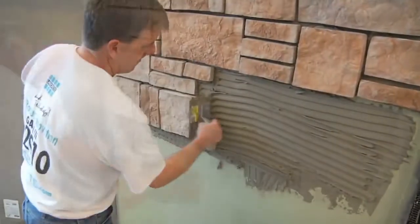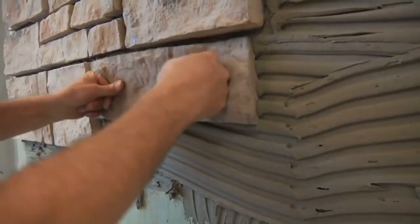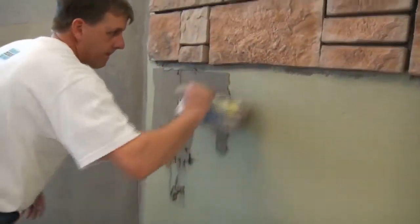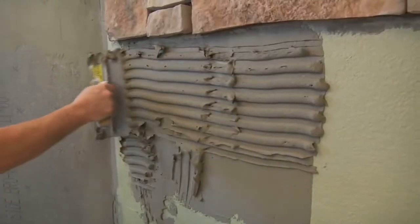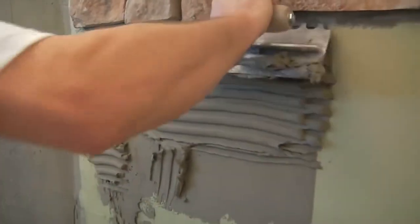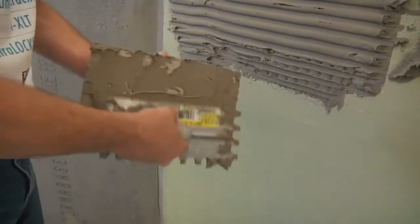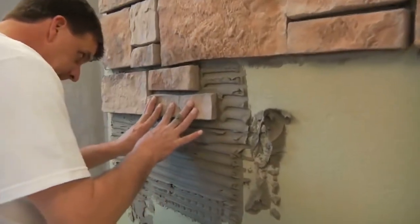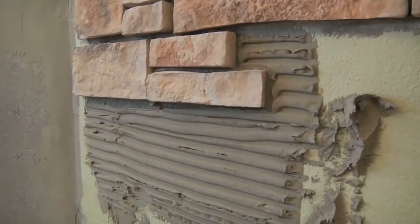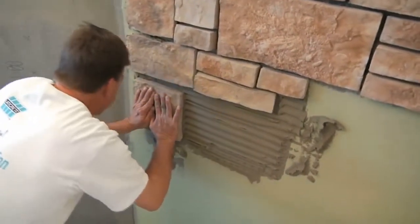As an alternative to the traditional method of veneer installation, the LATICRETE Masonry Veneer Mortar allows for a much faster installation as demonstrated here. Begin by keying the LATICRETE Masonry Veneer Mortar onto the substrate using the flat side of the trowel. Next, using a one-half inch by one-half inch square or three-quarter inch loop trowel, comb the mortar horizontally, making sure to apply an even amount. Apply a thin skim coat to the back of the veneer. To install the veneer, simply place in the desired position and press firmly, moving the veneer up and down slightly until the exact position is achieved. The LATICRETE Masonry Veneer Mortar will hold the veneer in place without any sagging.